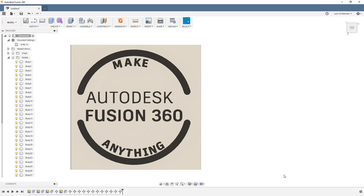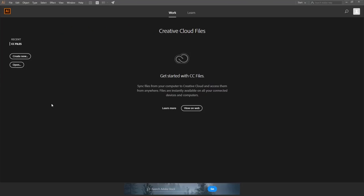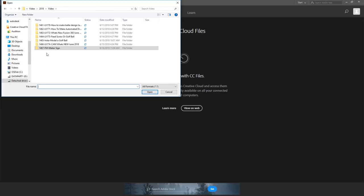We're going to start inside Fusion 360 and this is where we want to end up — something like this file here as the end result. Font was going to be important to make this sign look as good as possible, and this is a good time to talk about raster versus vector. Fusion 360 is a mechanical CAD software, which means it needs real lines, whereas most pictures — PNGs or JPEGs — are pixelated. So I'm going to convert a pixelated image to real vector, and for that I'm going to use Adobe Illustrator.